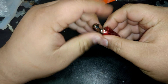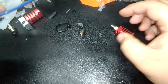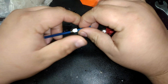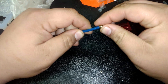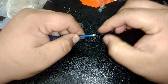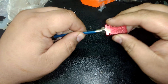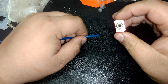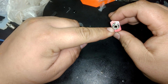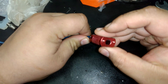Now, if you've never seen how a compression fitting works, it's very simple. We're going to demonstrate how this is going to work on a Mark 8 hotend. First, we take our Bowden tube — I've only ever worked with this kind of setup with a Capricorn Bowden tube for consistency — and we use a single brass ferrule. Double ferrule systems I have no idea if they'll work, I've never tried them. Single ferrule seems to work just fine. Now, we do still have this one problem where because these are meant for water lines, you have to drill out the center because there's a little stop right there. Once you drill out the center, you should be able to poke the tube all the way through.